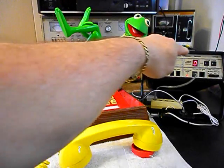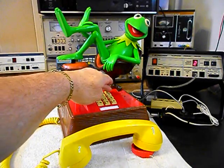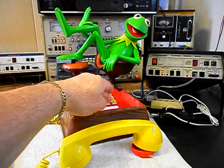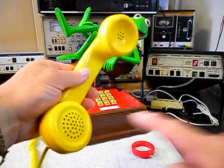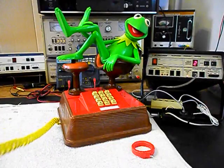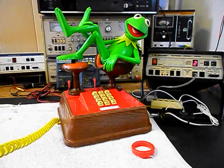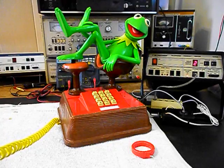Now we want to walk through our numbers. If you watch the analyzer, you'll watch the numbers roll by. I'm going to end in a 2. Now I want to transmit into the handset — watch that red light on the analyzer. Every time you see that red light light up, that's an indication of 100% modulation on transmit. 1, 2, 3, 4, 5, 6.